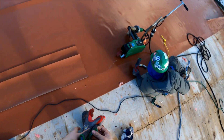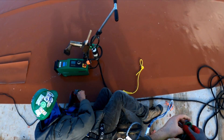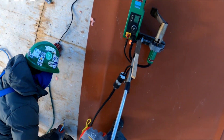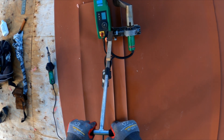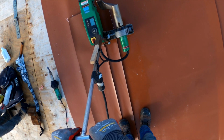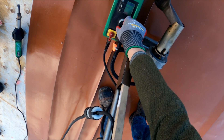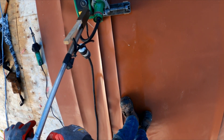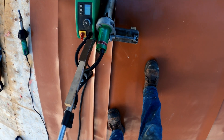To start, I need to cut strips one foot wide and six to seven feet long. Using a pen, we divide that into four equal parts and I set the automatic welder. I'm using 80 mil PVC membrane, which is a little thick, and because it's winter and the temperature is minus one, I'm using 460 degrees and 100% fan. I'm using various speeds — 1.82, 2.2, 2.4, and 2.6 — and I just play with the speed using the pen.